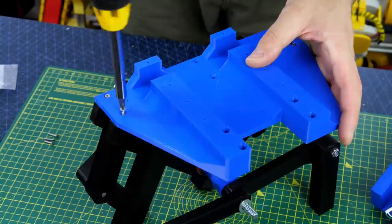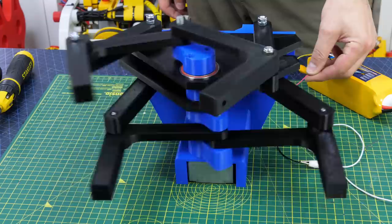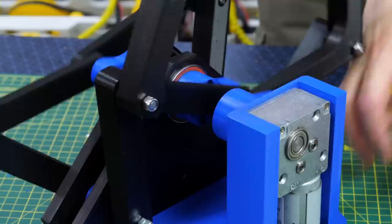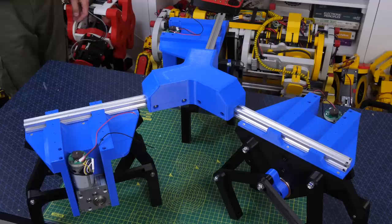We need a lid on there so that we can attach the motor and space everything apart correctly, and I've put extra ridges along the top there so it's super rigid and it won't flex too much with the load of the motor pushing those cams. It's quite difficult to drive that central drive shaft in any other way because those levers overlap the center of the main camshaft, and that means we'd have to use a belt drive or something to take the motor off center. That's why I've used one cam on the motor to drive one of the cams we already have on the central camshaft.